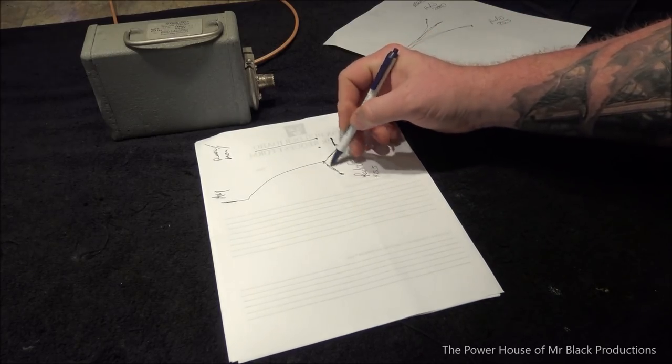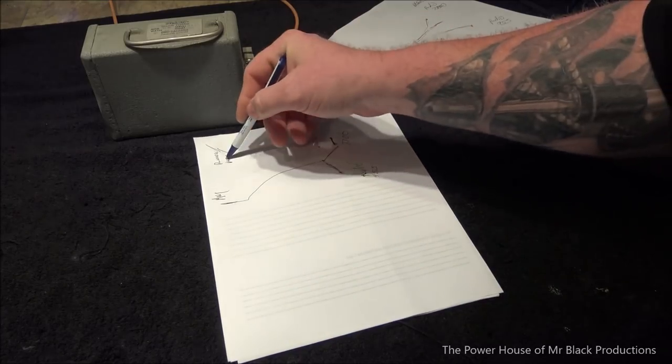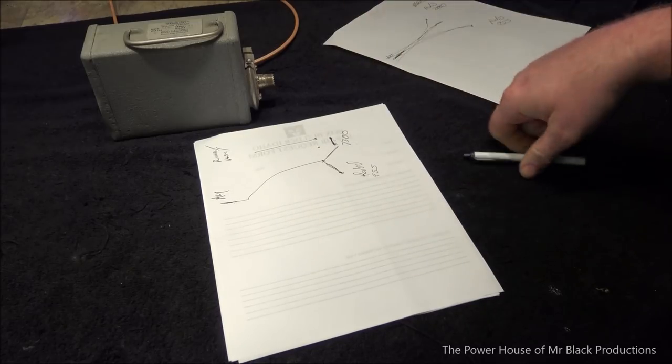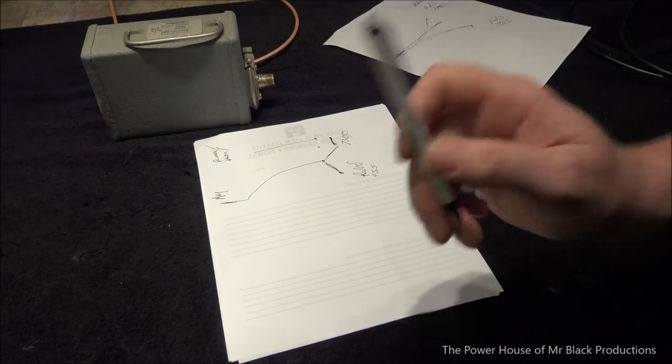This radio now takes sole control of the antenna. This RF gets dumped off into a dummy load. So they both go into transmit, but now this one's technically muted. You're not going to overload the receiver. That's really key.